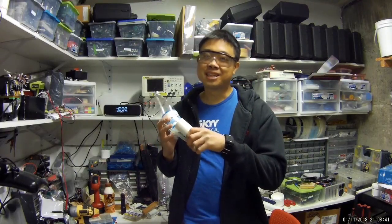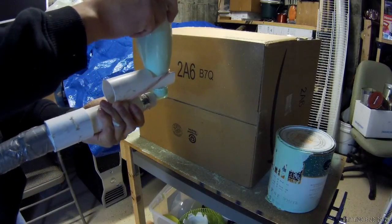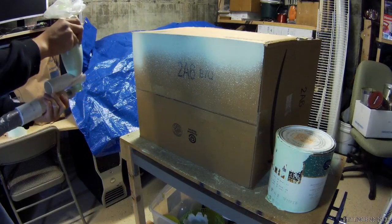I'm going to show you how to build a paint sprayer out of a plastic bottle, a couple straws, and some pipe. This paint sprayer requires some sort of air supply. I designed it to use with a shop vac, but you could use an air compressor or even a mattress inflator.